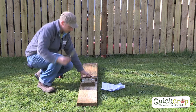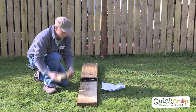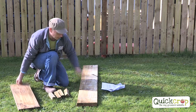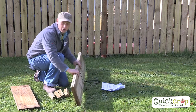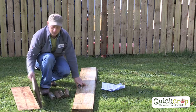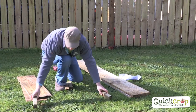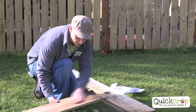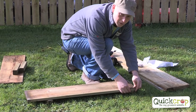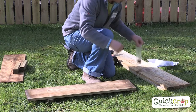I'm going to use a pair of scissors to cut the plastic strapping. What you should have are four of these corner posts, two of these shorter lengths of plank, and then two of the 1.8 meter long ones. I find the easiest way of doing it is to use the short planks first. So we're going to take two of our corner posts, place them on the ground, and place one of the shorter lengths of plank over the corner post — lining it up so it's flush with the end of the plank.